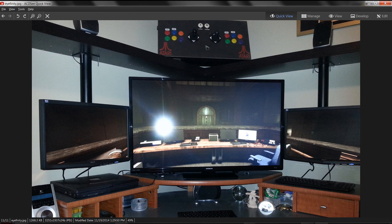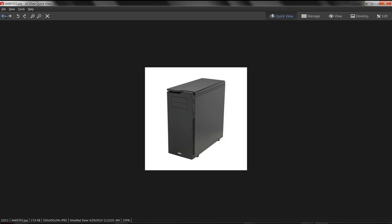Back in 2001, I built a set of analog arcade controls to plug into the computer. This winter I'm going to convert this to wireless - it currently uses a PS2 connection. I've got a laptop battery and charging circuit, and I'm going to strip down an Xbox 360 wireless controller port, pull the circuit board out, and integrate that along with the lithium pack to make it wireless and rechargeable.